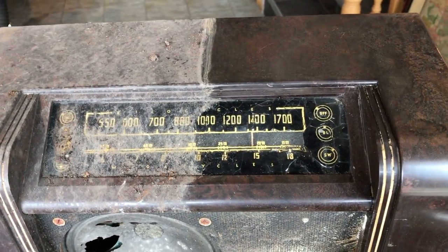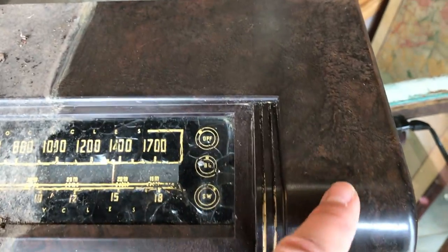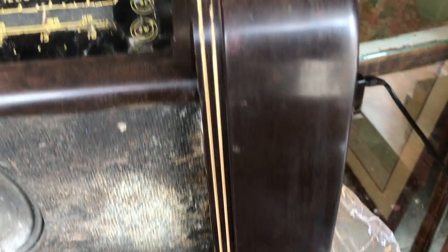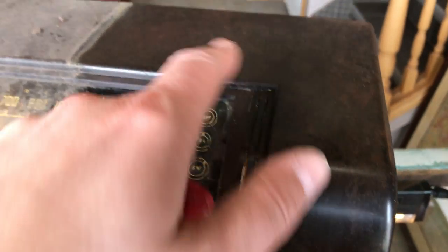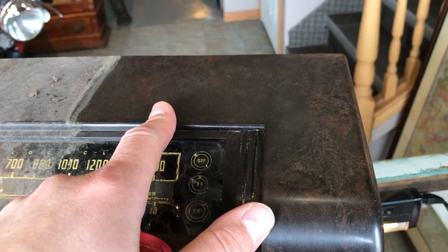You can definitely see that starting to take shape — the dirt is coming off. I've given it a scuff with a thousand-grit steel wool and it's nice and smooth, not dirty and covered in pigeon droppings anymore. The marbling is starting to show through on the old Bakelite. I've done the side as well. Next step is gonna be polishing — there would have been cloth here that's missing, but for this demonstration I'm just focused on showing you how to polish the Bakelite.